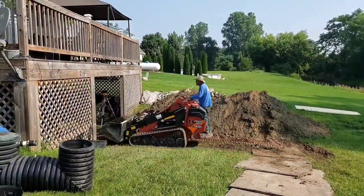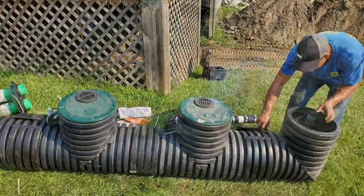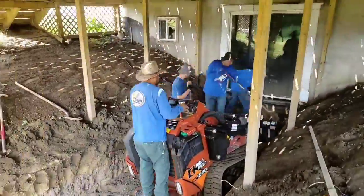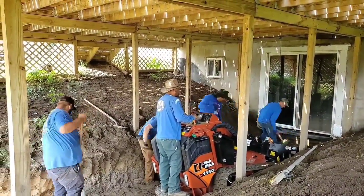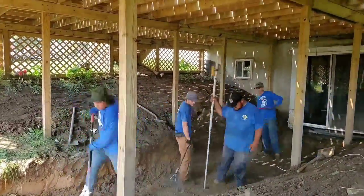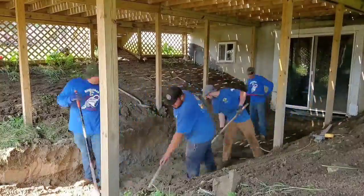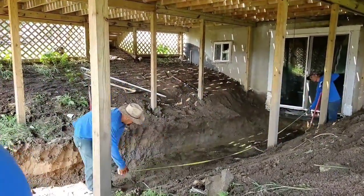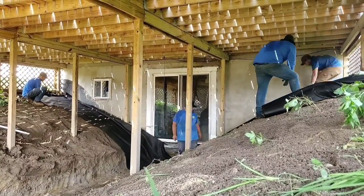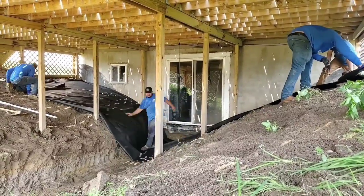Francisco is setting up the duplex system — he's taking two of our Bad Seed sump pump systems, full frame 24-inch, one-third horsepower, and making a duplex. We take the exact same thing that we build and ship all over the United States and he's reconfiguring it on site, because we added 10 feet of chamber along with a heater — we're in the north, so we have a thermostat-controlled heater. Make sure your sump pit bottom is level — the guys are using a laser level. Then they take filter fabric across the entire bottom of the deck area so the homeowner can put decorative stone on it later.